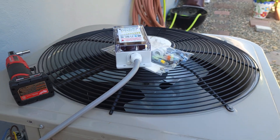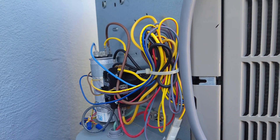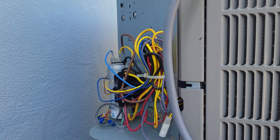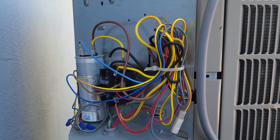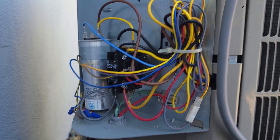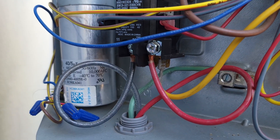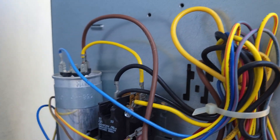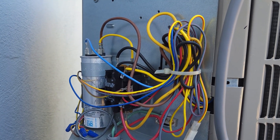The reason I'm doing this video is because on YouTube there aren't a whole lot of videos on installing on a Carrier or Bryant unit. I don't know if that's just a regional thing. Even if you do watch those videos, you'll notice that the wire color codes are all over the place. Black wire is always the same — that's one leg of the 120 — but the red, sometimes it's white. The power going into the compressor, on mine is yellow. The hermetic is blue. It's just all over the place, so you can't go by color.